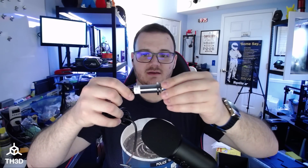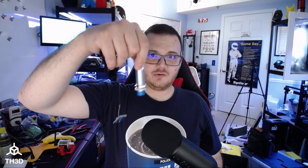We're going to run through the basic steps that happen once you have the kit installed and the firmware loaded and configured. The first thing you want to do is physically get the sensor installed. These boards get installed in a case — this is the actual sensor module, an 18 millimeter sensor, and this will go in a mount that goes on the head of your printer.